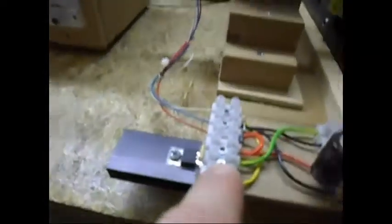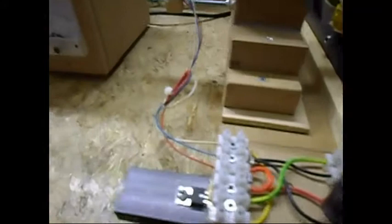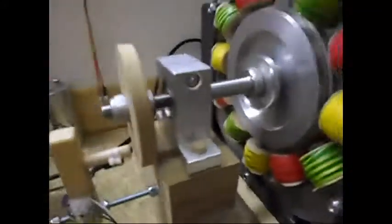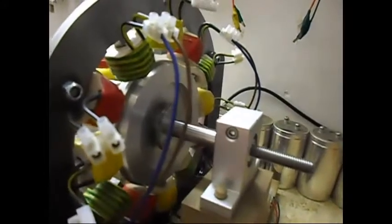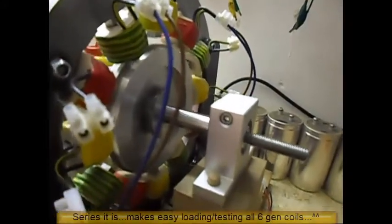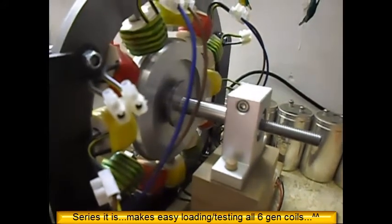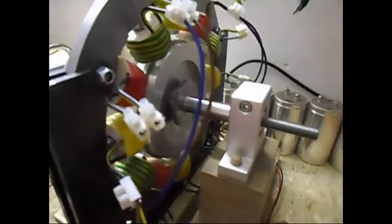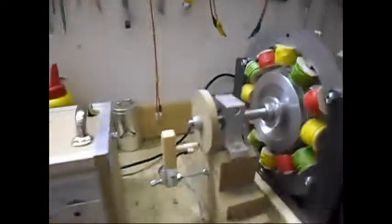My input lines — very simple circuit, just a P-channel. I have a better circuit but for now it is working okay. Next step of course will be to wire some of these generator coils. I think I am going to put them in series — it is easier in series. Then I can short them all and put them on a load and see what happens.